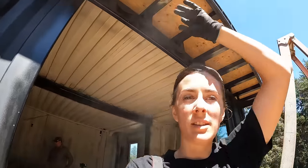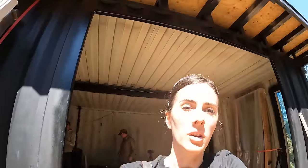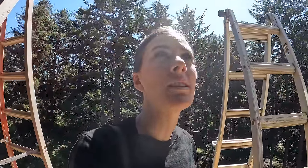Oh my god, we managed to finish drilling the steel frame for the sliding glass door. I lost track of how many drill bits we broke. We broke quite a bit. The problem is that the screws are relatively small. They are right about 1/8 thickness, so we can't really take a drill bit bigger than 1/8, obviously, because then the thread won't catch the steel.